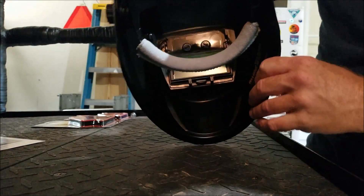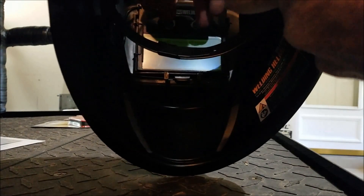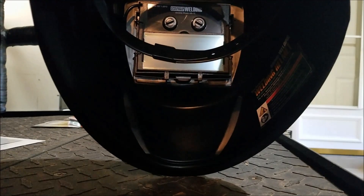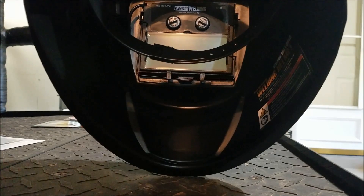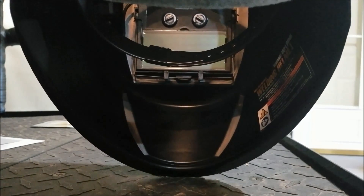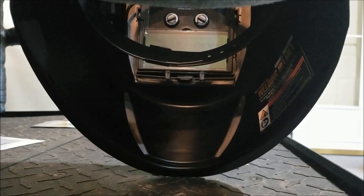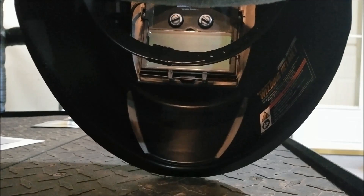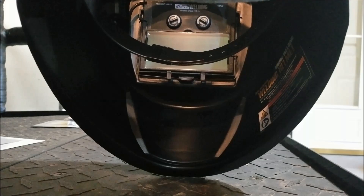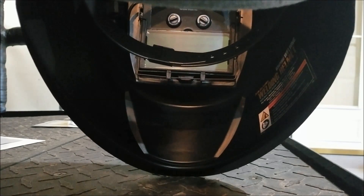The reason why I wanted that specific item number — and I'll show you this here if I can get a good shot of it — is inside this helmet it has these knobs right here. There are no on/off switches. Some of the other models will come with only an on or off position for the sensitivity and for the delay time. This particular model has a nice analog knob so you can really dial it in. Also, with the on/off switch style, those switches can go out quite easily, whereas with these knobs, when they do go out, usually it's only portions of the knob and you can still use other parts of the delay range. I've seen these tend to last a little bit longer under daily use, so that's why I went for this model.